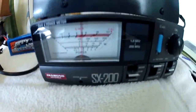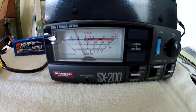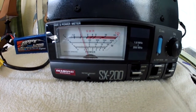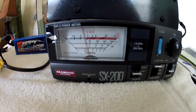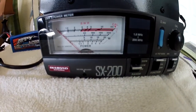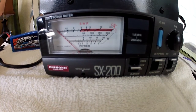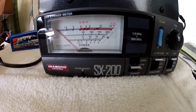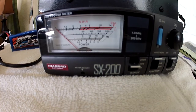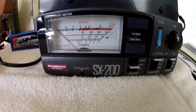If I go over to my power meter, you can see that I've got peak power fluctuations as expected, and I've got no reverse power fluctuations. So obviously, while the KX3 is showing some SWR instability, this is not being shown on the inline SWR meter.